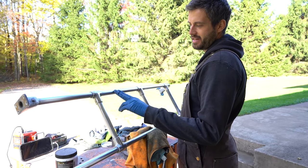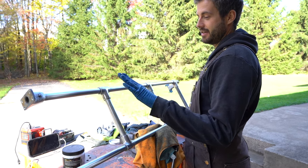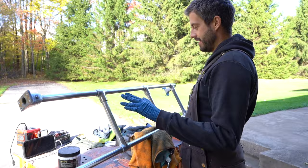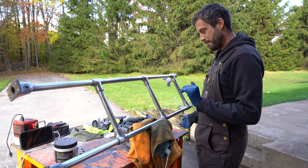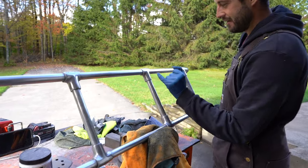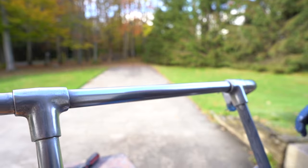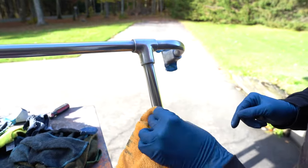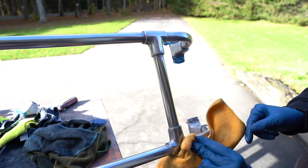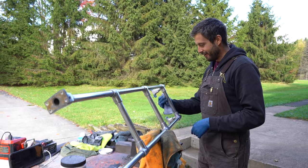To get this, we did 80 grit sandpaper and worked our way to 2000, then pre-polished wipe down. Over here was the same process, but we did the final polish and it came out this deep mirror finish, and that's what we got going on over here. It's basically hours of polishing. And we didn't have to throw anything away, so that's cool.